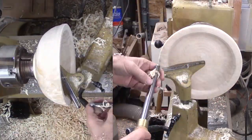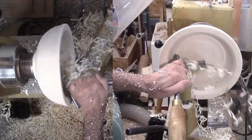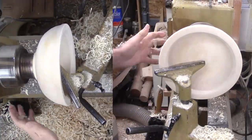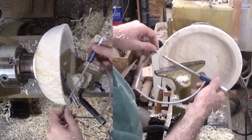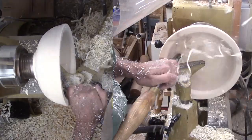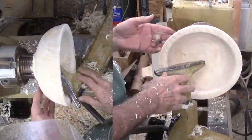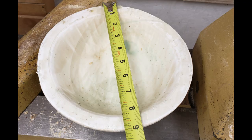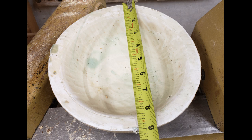After checking for consistent thickness, I can coat it with greenwood sealer and put it in a paper sack. It will stay in the sack for two to three weeks then continue drying outside. The wood has stopped drying at 725 grams having lost only 107 grams. With only 13 percent weight loss, the burl was not fresh cut. It had to be drying some before I turned it. This may have been the source of the nasty crack. Turning more quickly after harvesting might have saved it. The burl has not warped dramatically, probably due to the burl figure. It does have a typical hump at the end grain.